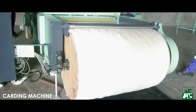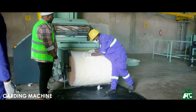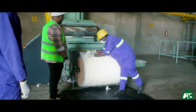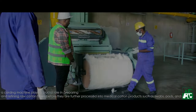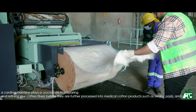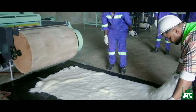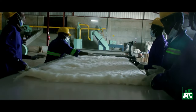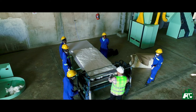The material from the material feeding machine is delivered into the carding machine as a thin layer of cotton web, which is collected in a cylindrical shape drum through the high-pressure chute. The collected absorbent surgical cotton feed bat from the wooden drum is collected manually and fed to the rolling machine to form a roll.